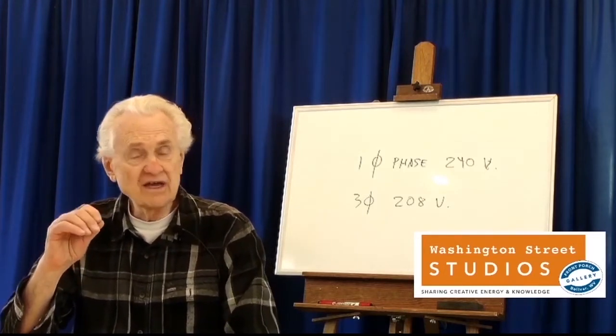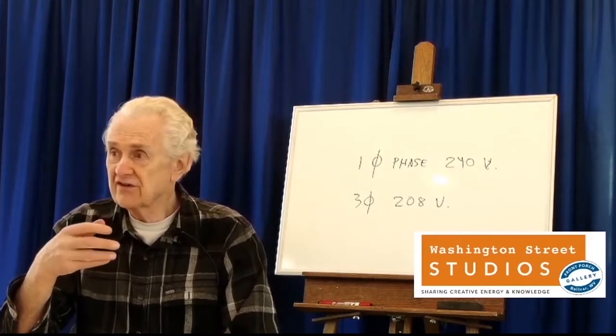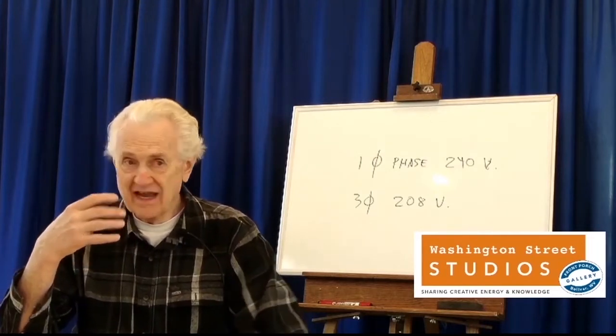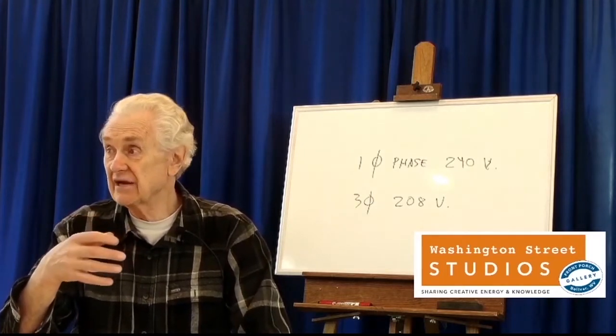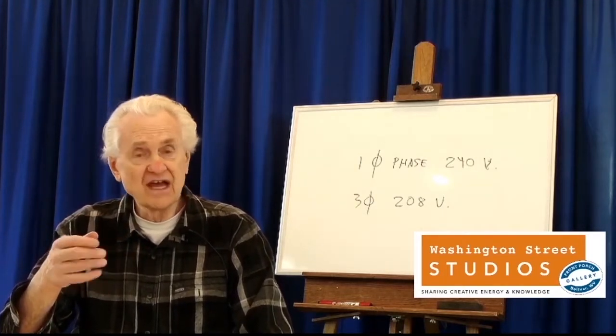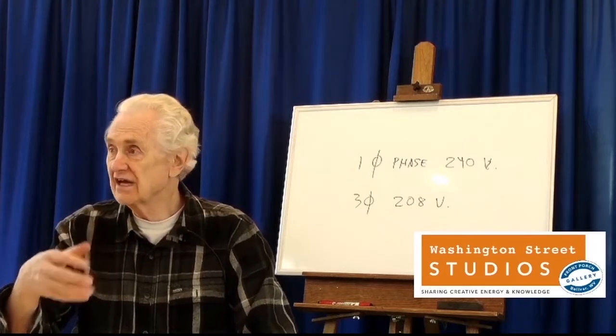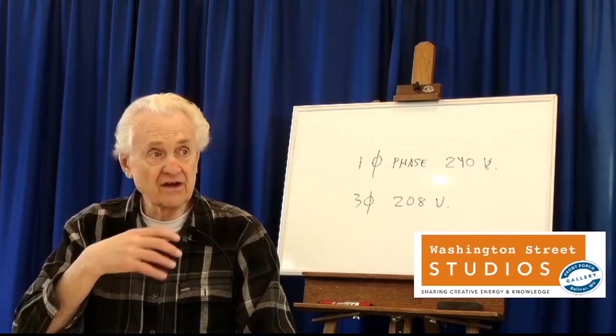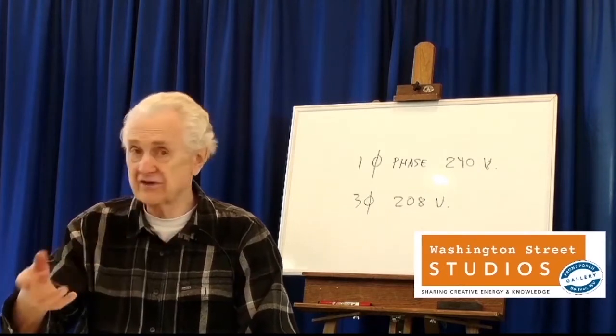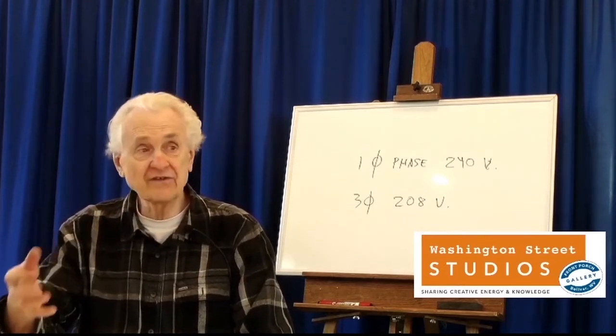The other thing to look at is what's the amperage that the kiln requires? Because depending on what your house or the location is, you want to make sure that amperage is available. Some of the larger electric kilns are now drawing 60 and 70 amps. And the question is, can you get a line? Do you have power available? Let's say in your house, do you have enough free lines in your circuitry that you can add a 70 amp line?